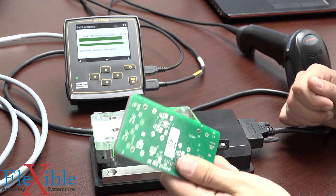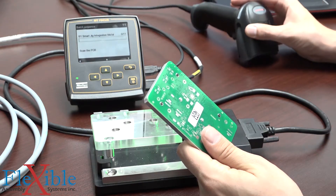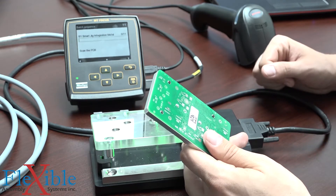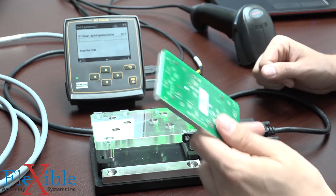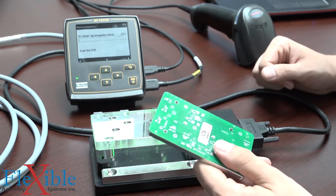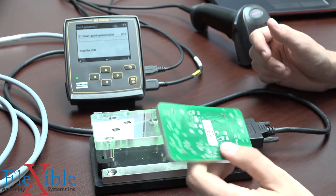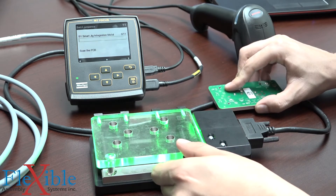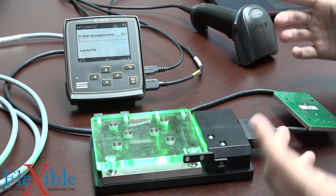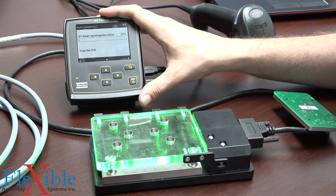And that's how simple it is to run a batch sequence here. There are a lot more tools that we can integrate, such as the stack light and other things, but the lighting indication on the Smart Jig itself is a good enough indicator. We didn't have any bad screws, but if we did, it would have glowed red and we would have had to redo that screw. There's a lot of flexibility behind these batch sequences. We'll be getting into more details with all of these accessories in other videos, but I hope you enjoyed this one and it gives you a good idea of what you can accomplish with the MicroTorque Focus 6000 controller.